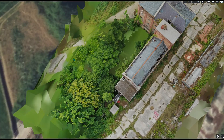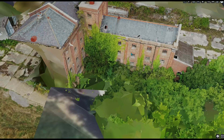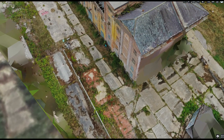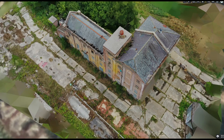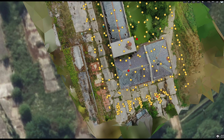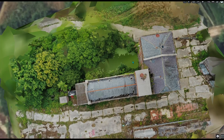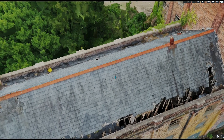If we scroll around, we came right out over this side as well, so it's captured all of this greenery and this side pretty well. However, the front of the facade is pretty much nothing, and the same for this side. A percentage of the back is missing due to overhang — the nadir position won't pick this up. There's not a great deal of overlap down here, but there is over the back, hence why it managed to capture the back end of the facade. So generally, from a nadir position, this is very good — great for survey, but not so good for 3D modeling.